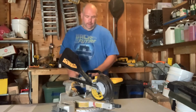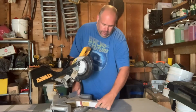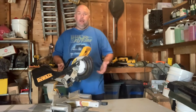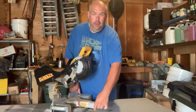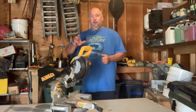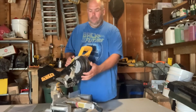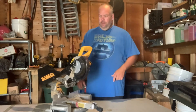I mean, this has everything you want. So it has a spring loader that'll pop up for doing just straight chop saws. In the front here, it's got, I believe it is 11 positive detents or indents. We'll lock at different, very common angles, like we all know what we're looking for. But what I like, you just push down right there, slides around, and then you can just snap it down into place and lock it. None of those chintzy handles that you have to crank down and tighten. None of that. I guess if I had to find one fault with it, maybe the plastic blade guard isn't super sturdy, but every miter saw on the planet has one of those.